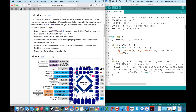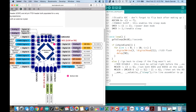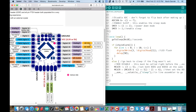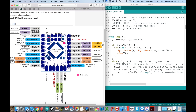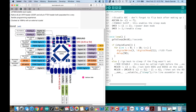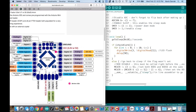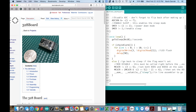Let me jump over to the ATmega328 board's wiki page to show you the pinout. Analog pins 4 and 5 are used for the I2C data and clock lines, tied right over to the real-time clock's clock and data lines with one 10k pull-up on each. Digital pin 2 is used for interrupt pin zero to wake up. This is a great diagram to help figure out all the different pins and their various functionalities.